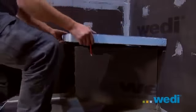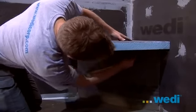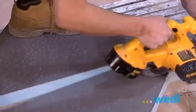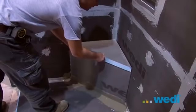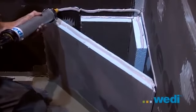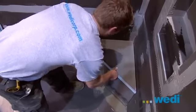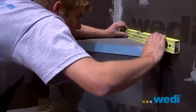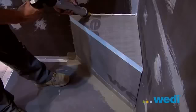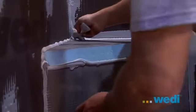It's easiest to dry fit the bench top to scribe the exact shape for your front cut. Now glue the top into place, and when it's in position, press the front edge down to create the appropriate top slope for water runoff. In essence, you're using the sealant as a wet shim to create the needed slope. Finally, apply your sealant to all edges and trowel flat.